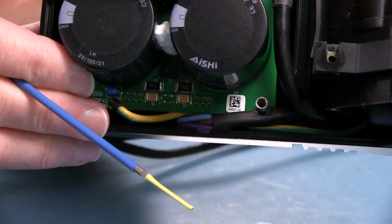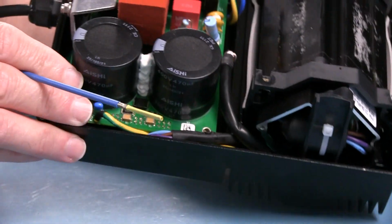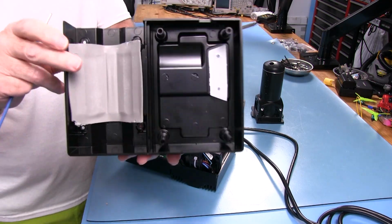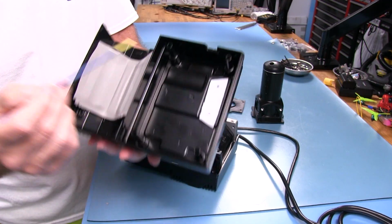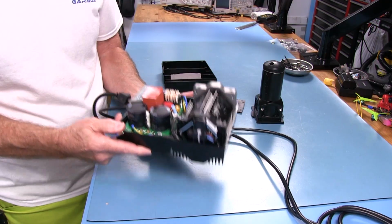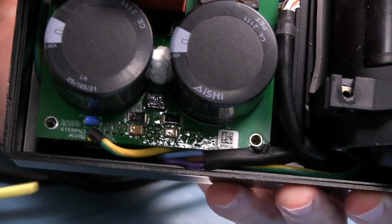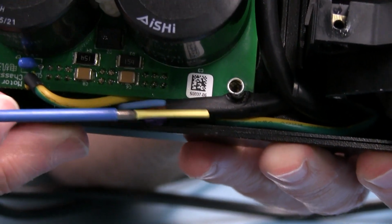And that came from getting pinched on the standoff on the side of the cover, on the other side of the cover. So we've got these standoffs in this cover here that obviously we're going to screw things to, right? You can see these standoffs sitting here. So one of these came in contact with that and compressed it, which is obviously not what you want to do. And I'm sure when D-Box sees this, they'll be able to talk to the assembly process personnel and figure out how to keep that from happening in the future. But yeah, you can see it pinched it a bit there. Now how close I can get this and still have some light on it. Right in there. Which obviously is something you definitely don't want.